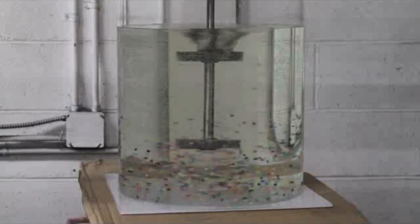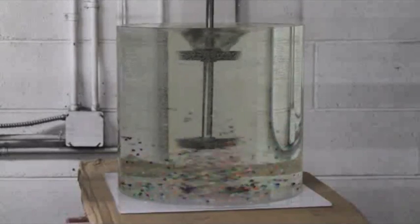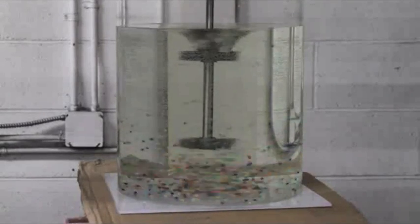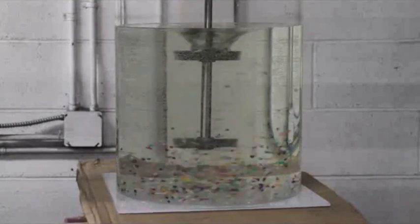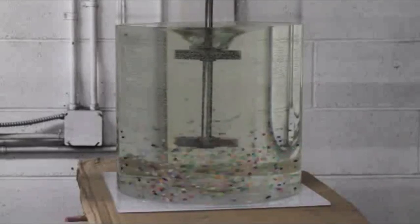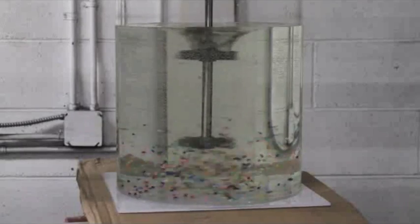This is the nominal blending effect that you get with an on-center mounted, unbaffled tank, especially at relatively low viscosities. In the full scale, we're operating at about 200 centipoise under normal circumstances, and that still generates this kind of a flow pattern, even though the viscosity is up around 200 centipoise.